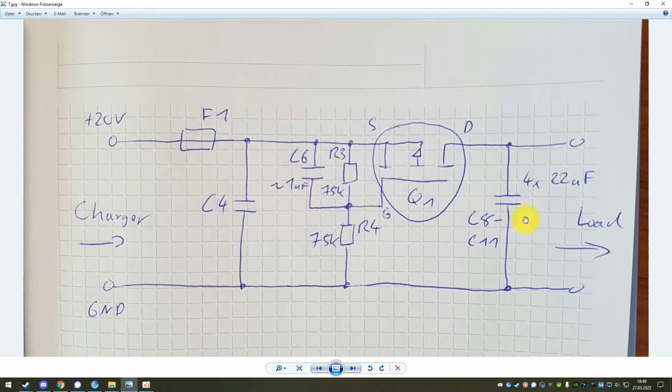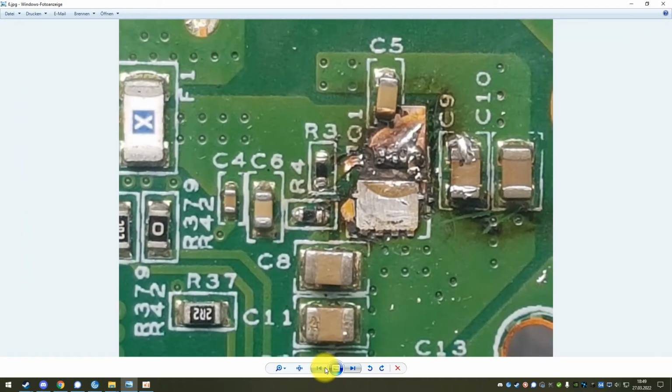So in this circuit that I showed you before, we have 4 capacitors. These are these 4, I will call them big guys for now because they are the biggest components in this circuit. So these are 4 capacitors, 22 microfarad, 25 volts each. And these are still pretty small considering that they are 22 microfarad. This is, I think, the 1206 or 1210 SMD package, which is, in my opinion and in my experience, way too small for a 22 microfarad 25 volt capacitor.